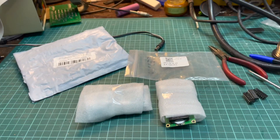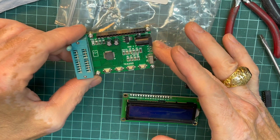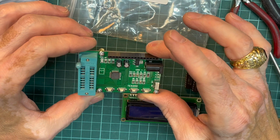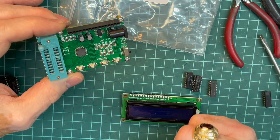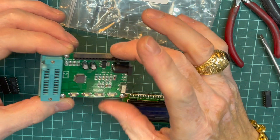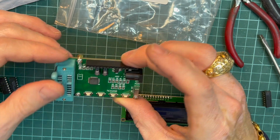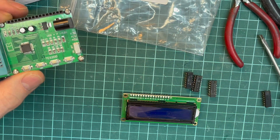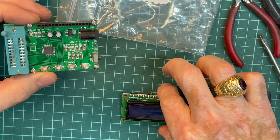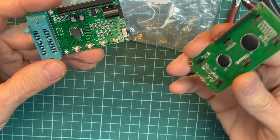This is the tester I purchased from AliExpress. The model number is the TES 200. The main purpose of this tester is to test logic ICs — the 74 series and the 4000 series. I purchased it mainly to repair my 8-bit computers like the Apple II. Instead of building a separate circuit to test all the logics, this is the easy way.